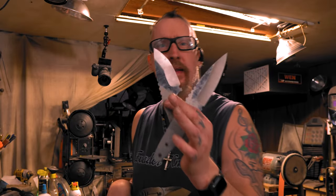Let's get these clayed up and ready. Now, I've done videos where I normalize the blades first, and I've done videos where I don't. I'm not normalizing, because I've tested them, normalizing and not normalizing, and really, I don't see that big of a difference. I've had normalized blades warp, I've had non-normalized blades warp, and it doesn't make sense unless you already have an oven going. If I was heat treating today and had a bunch to normalize for tomorrow, I might do it. But I really don't see any difference. I might be wrong, but I haven't had a problem yet. And I test them, I have a hardness tester, so I'm not just skating files. Unless you're forging and getting them hot, I don't see the point in normalizing.